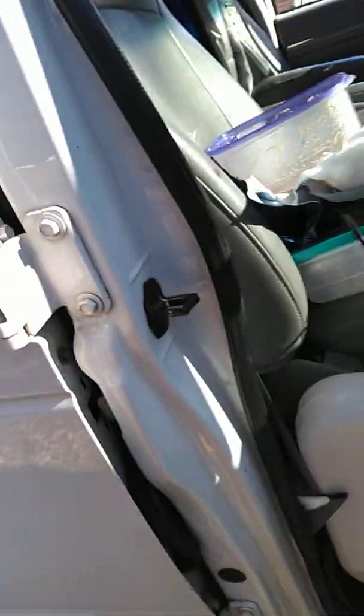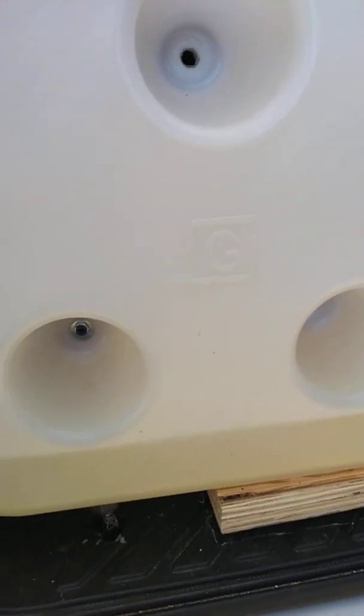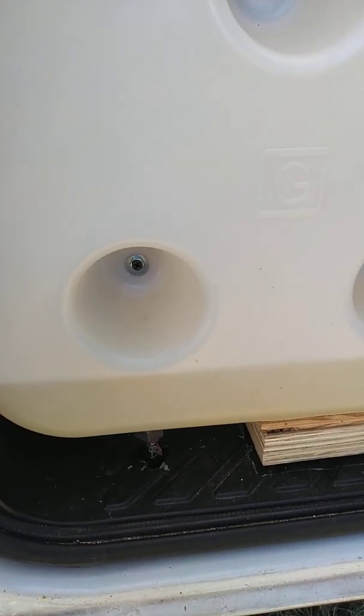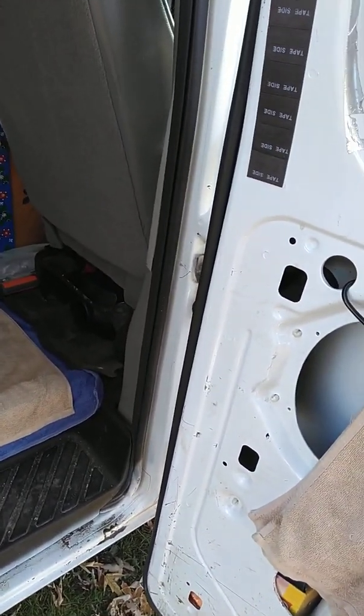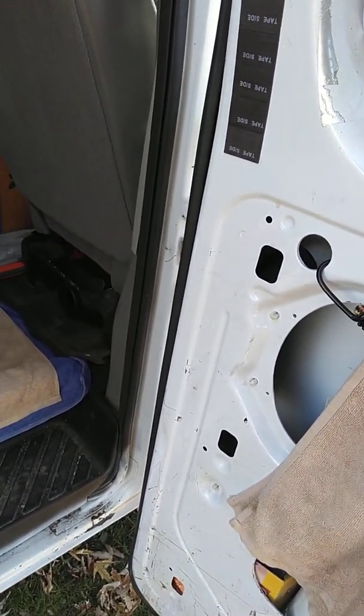Smell of diesel. I think I'm actually gonna start running. I'm gonna go to Rutter's in Lebanon and actually get the off-road diesel for this, so it's a little bit cheaper, but I'm not sure how that's going to affect the operation of the heater. I guess as long as, before I shut it off this morning, I put it up on its H6. The settings are H1 to H6. Put it on H6 for about 10-15 minutes, then turned it down to H1 and turned it off.